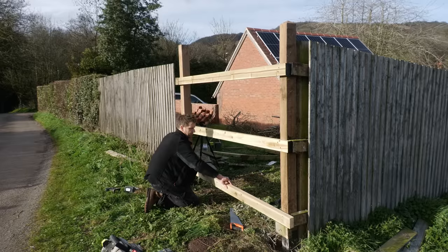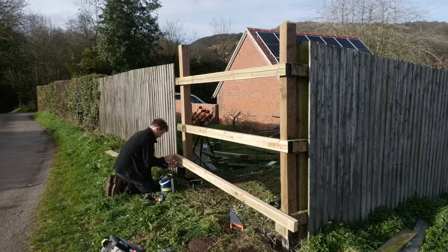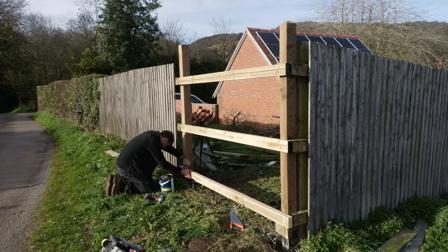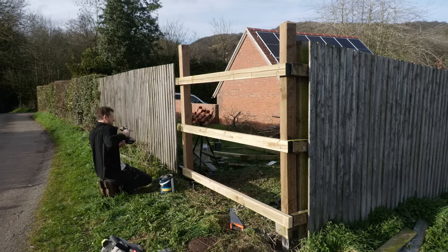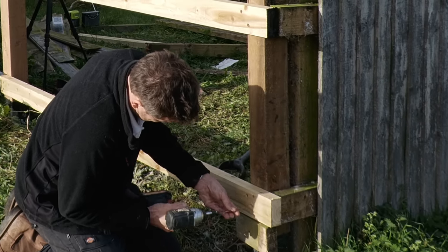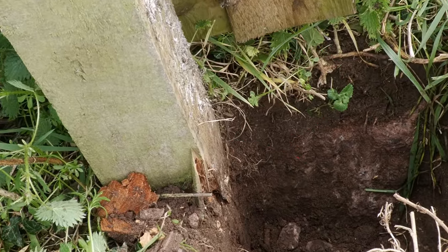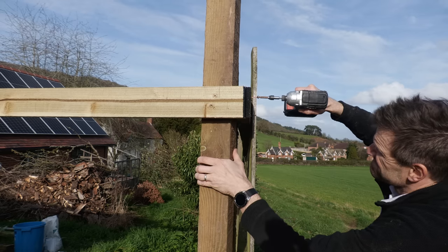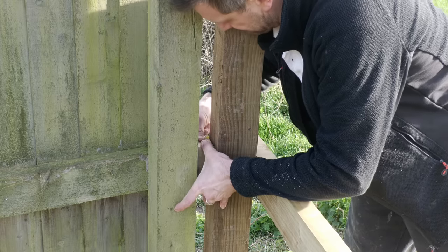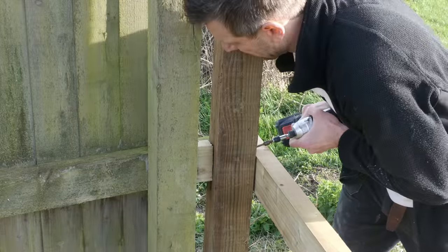Time to point out an error I'm really cross about. It was 4:15pm and with time marching I was so involved in the job I didn't think to check whether the fence was level before reattaching the existing fence to the new post. As you can see, it has sunk into the ground over the years and could have done with being raised 25 to 30 millimetres. The post next to the corner post had also rotted from its concrete base, but it'll be totally secure now it's screwed into the corner by the rails — I also attached it with an extra long exterior fixing screw.